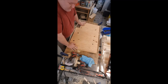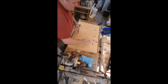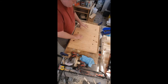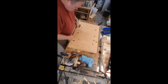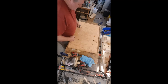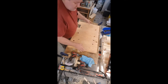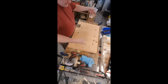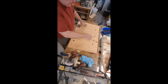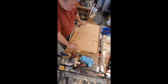This plywood I've cut to 33 and a half by 21 and 5 eighths. The beehives will sit here, center divider, shims, entrances here or there. I've determined the entrance is here because I've already drilled my drain holes here. I like to drill those beforehand because I can stack the plywood and drill four at a time — it makes a nice job because every cut is backed up.